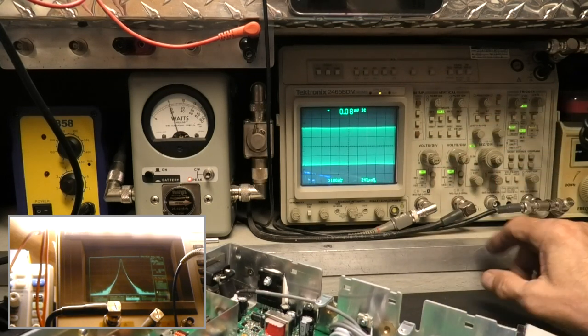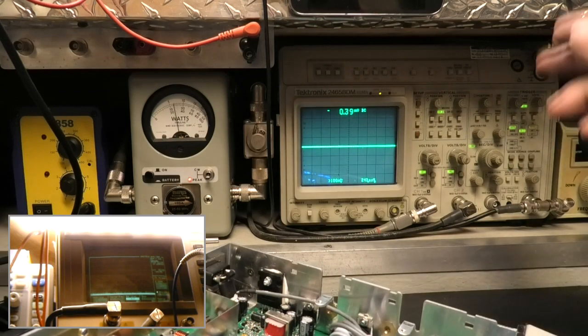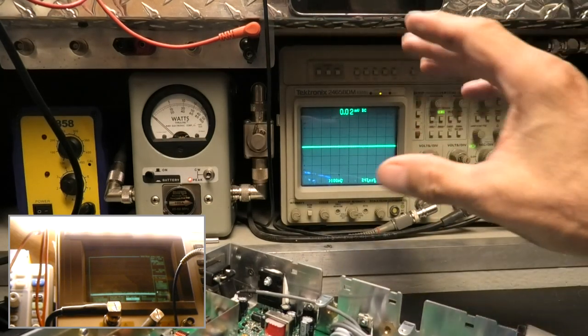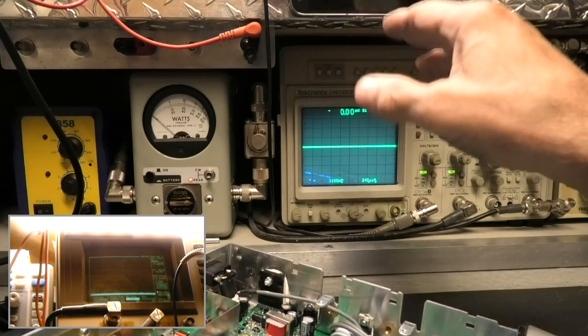So, let's consider this one bar up, one bar down. That's what it looks like. That's what the scope can do. Because it's such a much higher frequency, more than three times the fundamental frequency, it has no issues doing this. Matter of fact, you want to see other IMD and other things, you can do that with these.